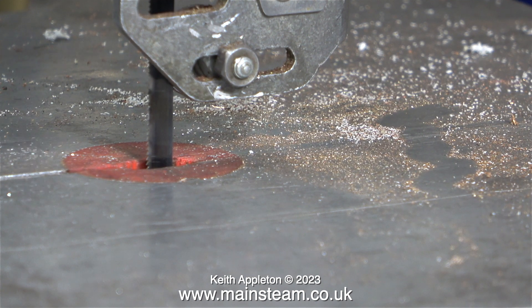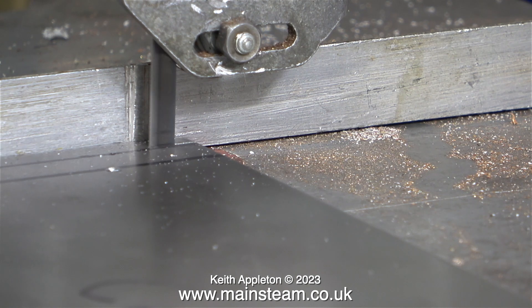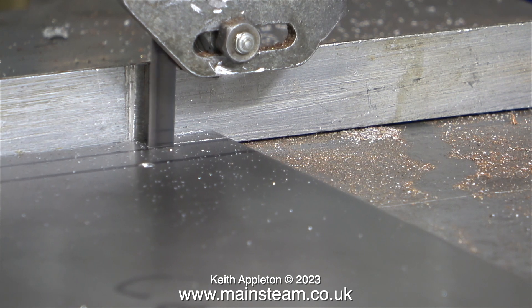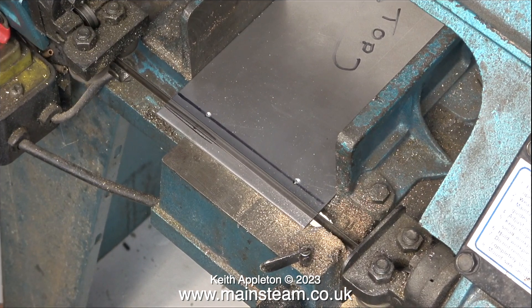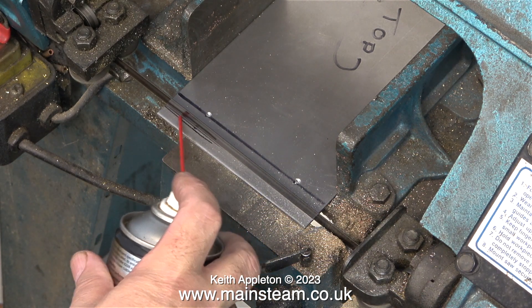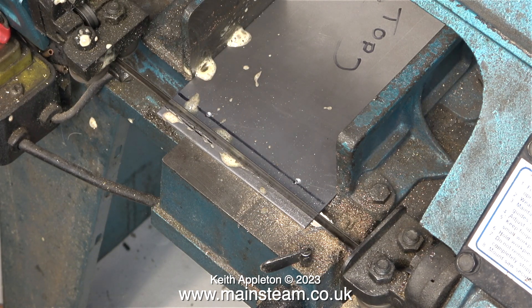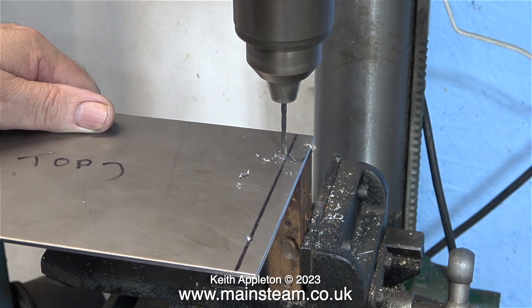I want to shorten this metal plate slightly — it's just a cosmetic thing. I've put the guide in place on the smaller of the two bandsaws and I'm trying to cut the piece of steel all the way along. This small bandsaw is quite good for brass and okay for round section steel, but it's not too good on this flat steel, which is very hard. A better idea is to use the larger bandsaw — I've fitted the piece of steel in and I'm squirting some lubricant on it. The lubricant can is at very high pressure and it goes everywhere; really an ordinary oil can would have been a better idea. I only used the aerosol lubricant because the can was quite close to the bandsaw.